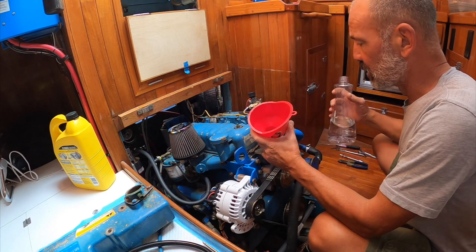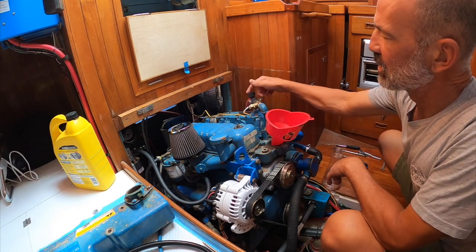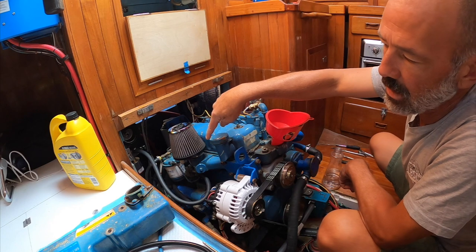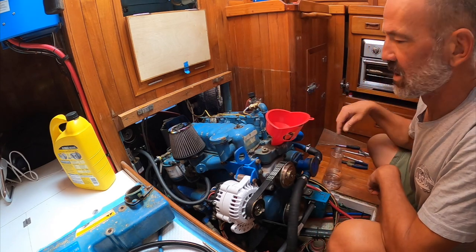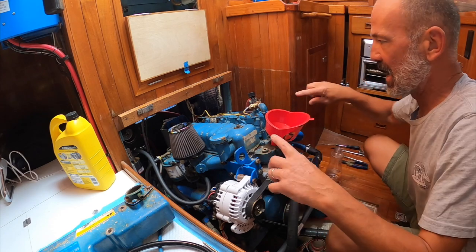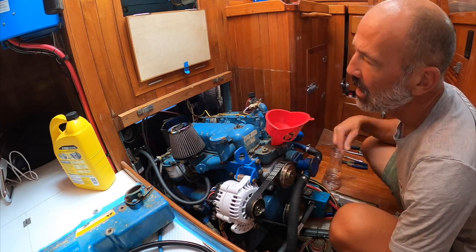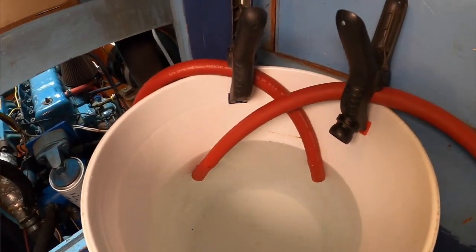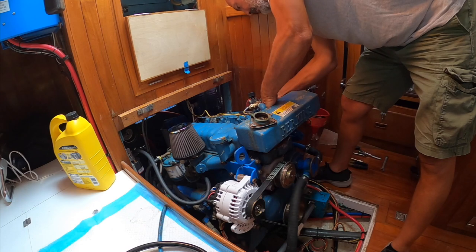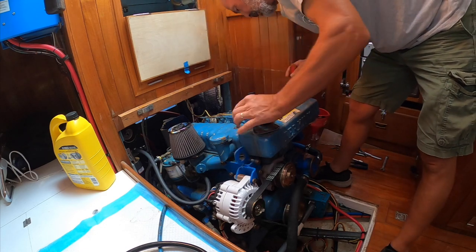Before I put the header tank back on, I'm filling the block back up with fresh water. This hose coming out the top of the block used to go to our water heater, then out the water heater back to the engine oil cooler. I disconnected it and ran one hose from here back into the lazarette, and the other hose from the transmission cooler back into the lazarette. So I'm going to put a bucket of water in, run the engine, see if I get circulation, see if any crud gets knocked out. I'm just troubleshooting this logically. If anybody has had problems with their Perkins overheating, please leave a comment.